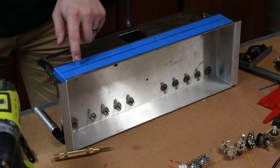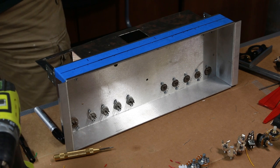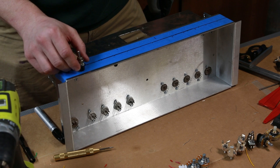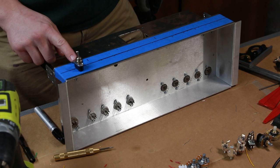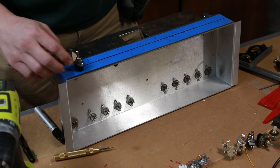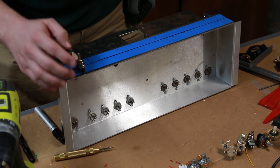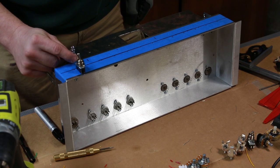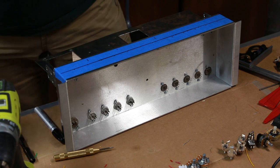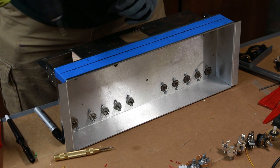Okay, I've marked them all — you can't see them all. A couple of these I've had to go higher and lower from that center line, for example I put the input jacks and the power and LED lamp off the center line a little bit. I also had to be careful because I was trying to do about an inch between them on some of these. With these kinds of jacks, you actually want the soldered connections towards the top so that up is on and down is off — that's the reverse of what a lot of people usually think. That meant it was going to overlap where this would go, so I moved it up so it's lining up more about here. We will begin drilling the pilot holes, and then drill each hole to the size dependent on what we need — some I can use a regular bit, others I'll have to use the stepping bit depending on how big they are.